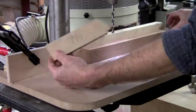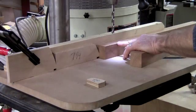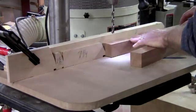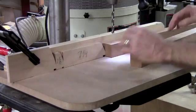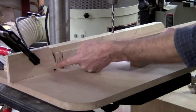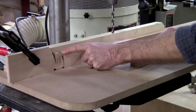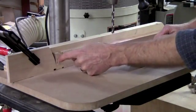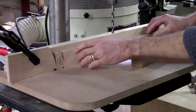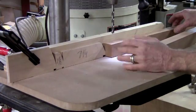By inserting a seven and a quarter inch spacer, that moves my part to this location for the two and three eighths inch hole. Then by simply inserting another short block in that place, I'll finish my third hole at an inch and an eighth. Now look at how these are made — I have a little space underneath for collecting chips so that the various inserts don't let chips prevent the block from seating against the previous one. I've also relieved the contact face so there's just a little bit of square at the bottom of each one, and that lets you see more clearly that your block is seating against the one next to it.